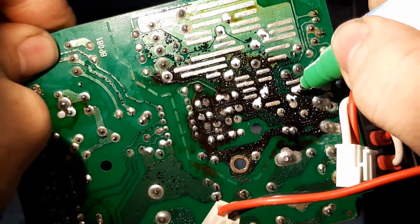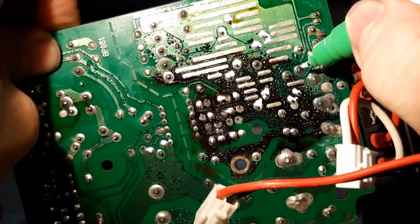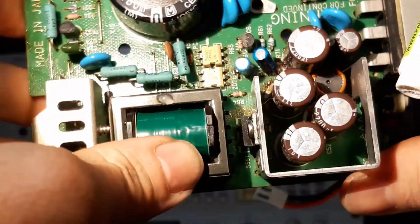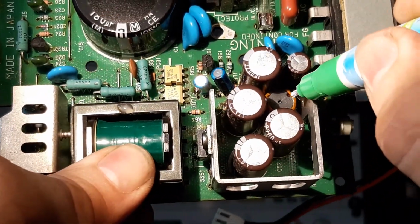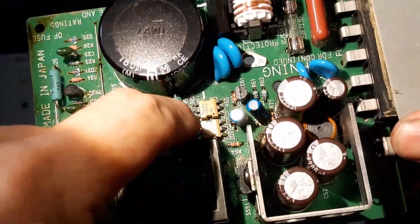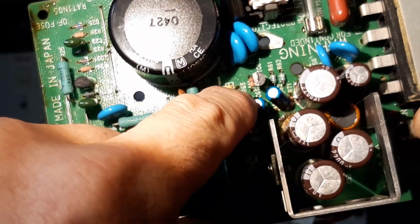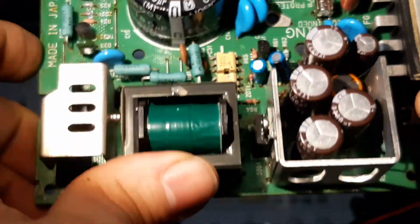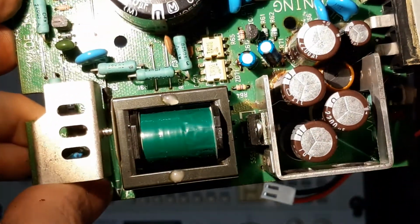But I'm just going to flip it over, and there should be a component above it, about 8 mil above it. It's got a pair. And sure enough, there is. It's that choke winding there. So that just confirms that you're in the right area. These little guys, I'm going to give you the values of these in a sec. Let's just flip them over and look where their legs are.